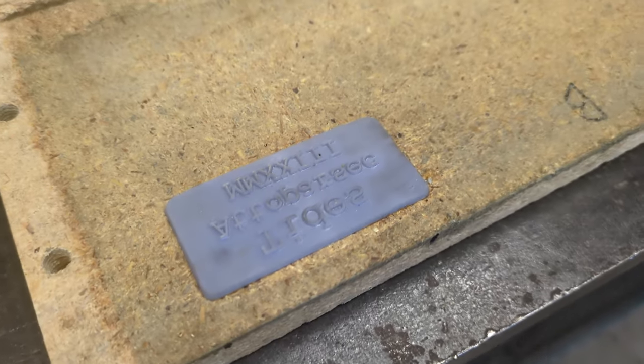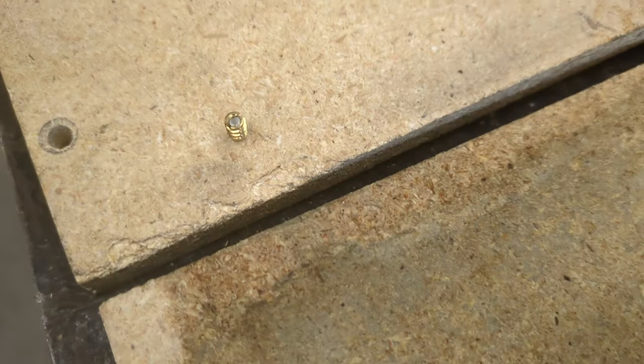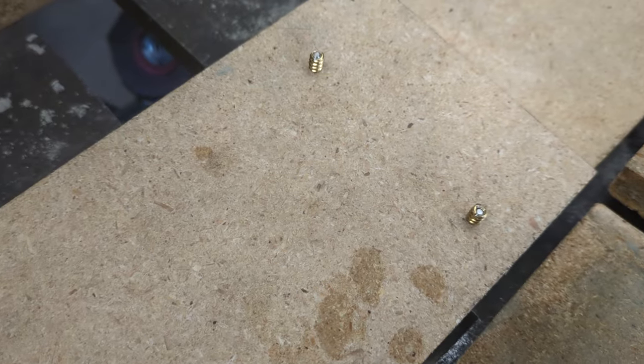On the other side, I drilled 4 new holes, through which another 4 threaded inserts were screwed in place. It worked so well for the mounting plate, why not for the rubber feet? This way, they would be very well attached, and not just stuck in place with glue or something questionable like that. If the not inconsiderable mass of this thing shifts during transit, I don't want them popping off.